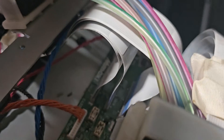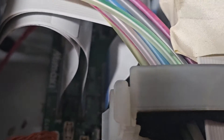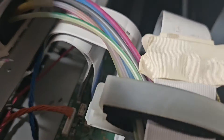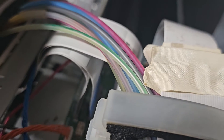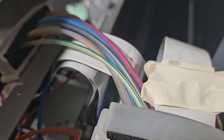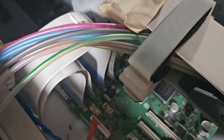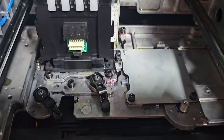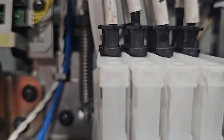One of the precautions I wanted to make clear is these flat cables — make sure that you install them nice and straight. This is vital; you double-check these over and over again. Make sure that you have them in right. If they're crooked, you could potentially blow the slider board or the printhead. So be very careful. Make sure they are ink-free — no ink whatsoever on those cables. If there is, you need to make sure you clean them. Allow time for the machine to dry out before trying to power it on, because that's a big mistake I see a lot of people make.